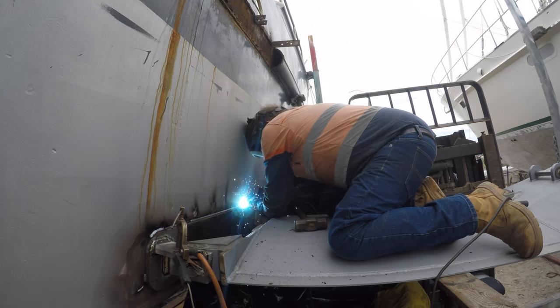While the boys finish up the last of the welding, they're just going across the bottom and then they're going to do the two ends, and then they'll go around and do the three full runs. So there's two additional runs to do on top of that first root run. Once we got that done, that's the doubler joined onto the boat. It ain't ever coming off.